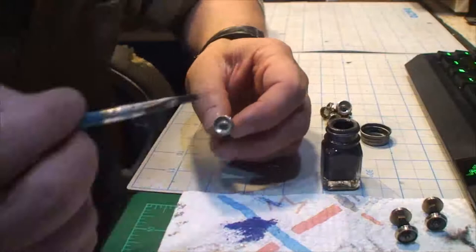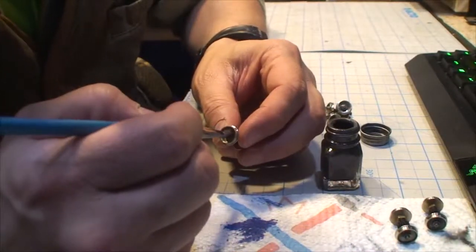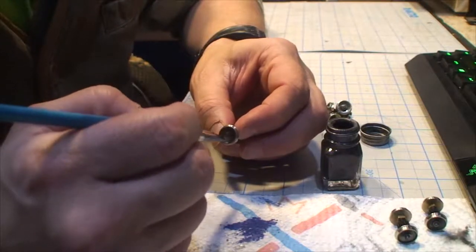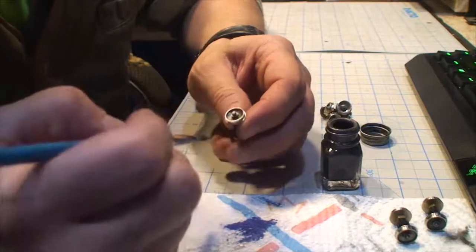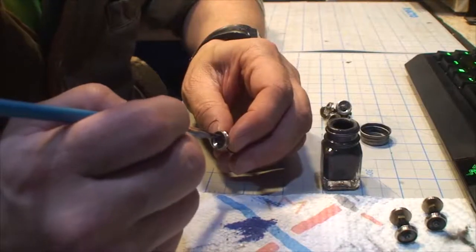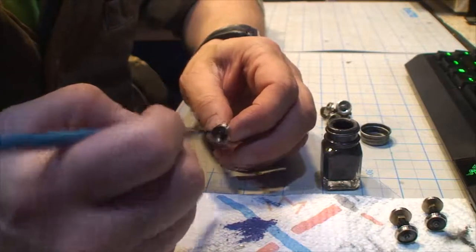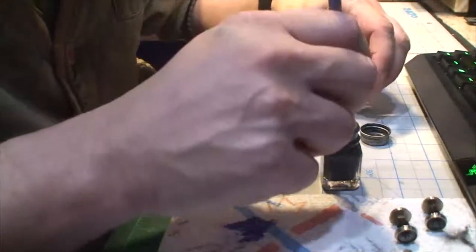Now, here's another little tip for you. If you were soldering rail joiners and track and putting on feeder wires, and you ran into some track that you could not solder to, probably because it was either true steel, which is made by Tyco, and I believe Bachmann makes a steel one too. And it's really hard to solder to until you put a little acid paste on there, and then it solders up no problem at all.